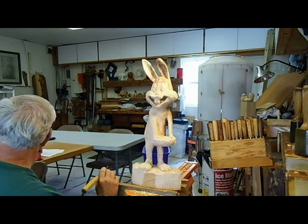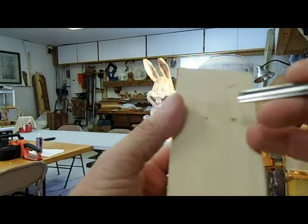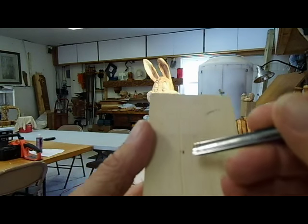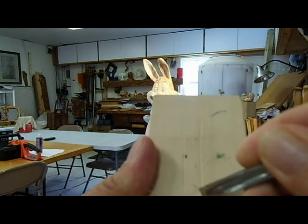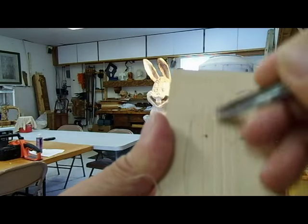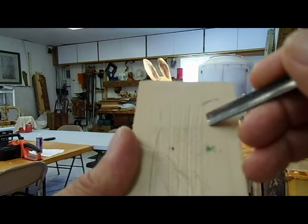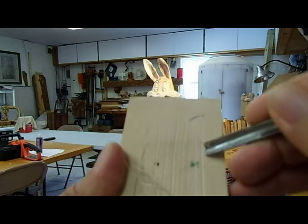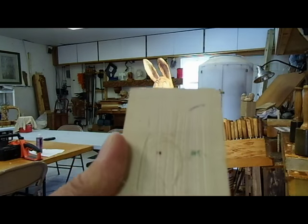To put the hair in, let me demonstrate. I think this technique is pretty nice. I've got a chisel — it is a gouge, like a number seven. It doesn't make any difference what the sweep is. What I'm going to do is use the chisel in this direction — I'm cutting a chip. You can see the chip curling up from the block. You can make a lot of lines in a hurry by just pulling it — I'm kind of plowing. I have my chisel skewed so it's not perpendicular with the cut, just skewed a little bit. I can skew it more for a wider cut and less for a narrower cut. See how quickly you can make lines for hair. Thank you for watching.